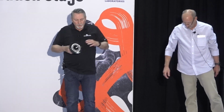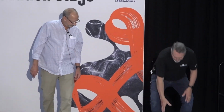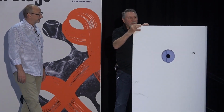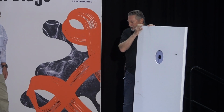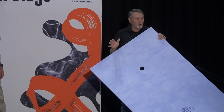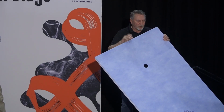Okay. So moving on to the base, now we're going to talk more about our custom bases, our custom base program. With our custom base program, we have foam-only bases, which is a 3-pound foam, 80 PSI. We have the honeycomb foam matrix base, which these all are here. That gives you, like Eric said, a 235 PSI rating. So we don't care what size tile you put on that. You can do penny rounds, doesn't matter. You don't have to worry about epoxy mortars or epoxy grouts either.